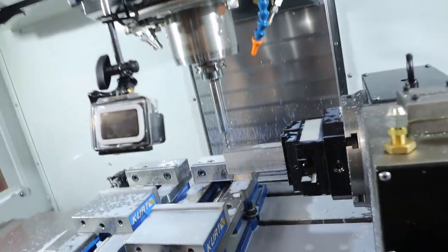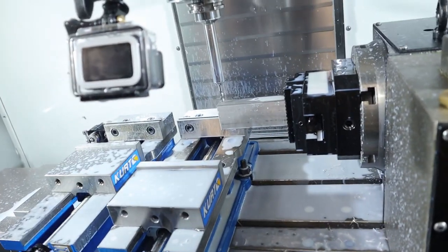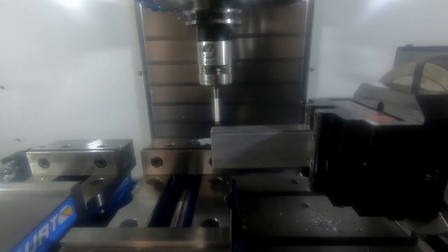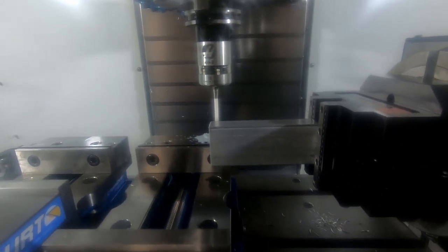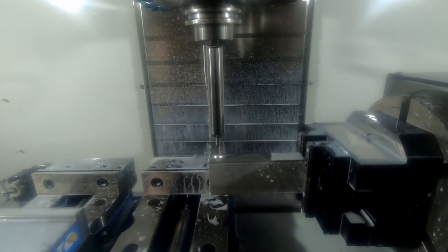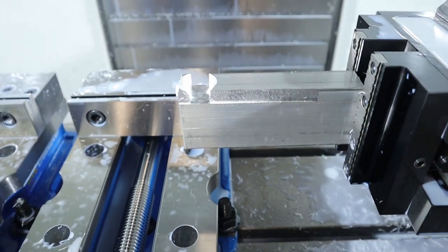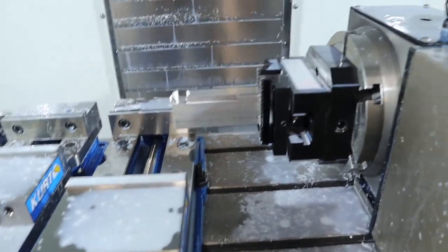All right, boys, here's what we're gonna do. I have our first tool, big boy, with a lot of stick out right here, and also stick out on the tool, so I'm curious to see how the actual chatter goes. Chatter, so I switched it up, changed tools. We're going to a 3/8 and shorter length, so we'll see how that runs.